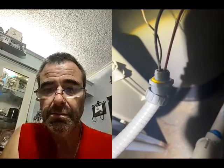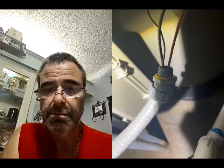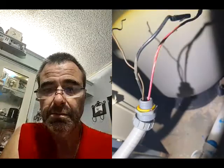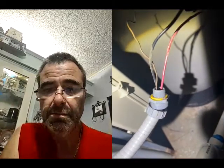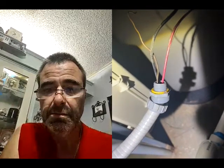There could be five or it could be four. If there's five of them, one of them is going to be a ground. You don't have a ground there. No, there's a separate one in the timer box for a ground. Right, but you don't have a neutral. You have a ground there, which is going to go on the bar. You know what I mean? Does that make it 240 coming out with the black and red? Yes, it does, if you have the black and red going off the 2 pole 20 that's connected together.